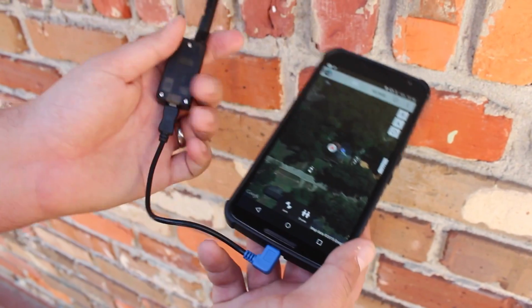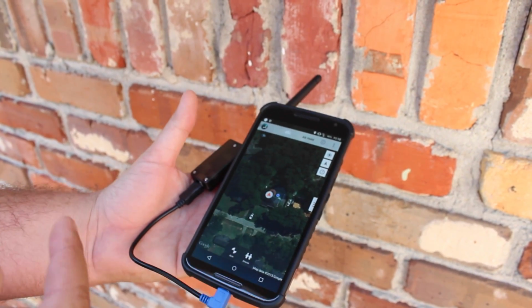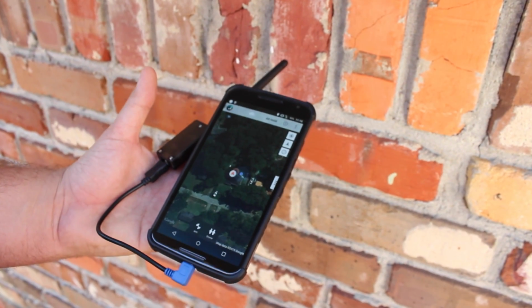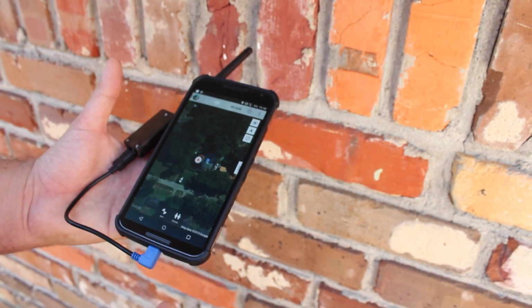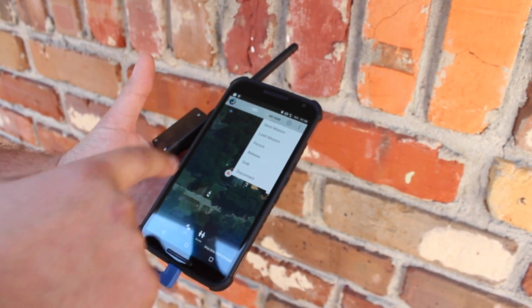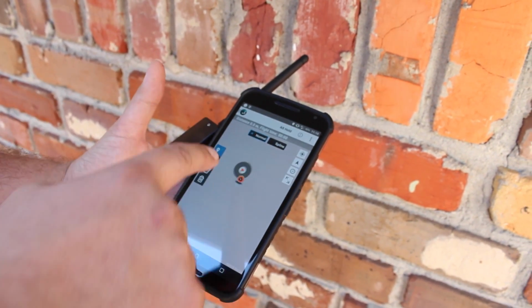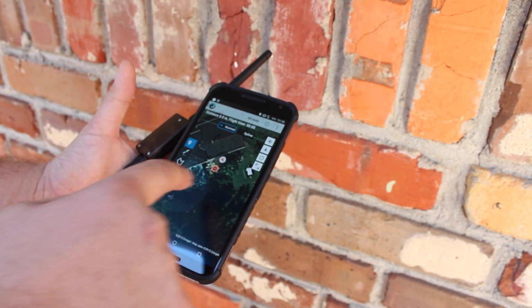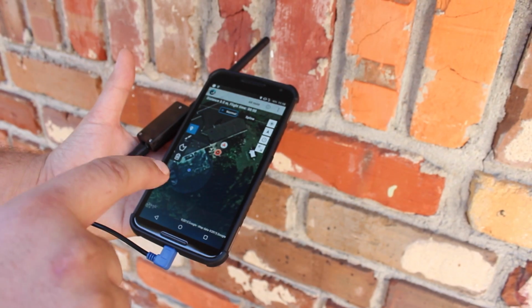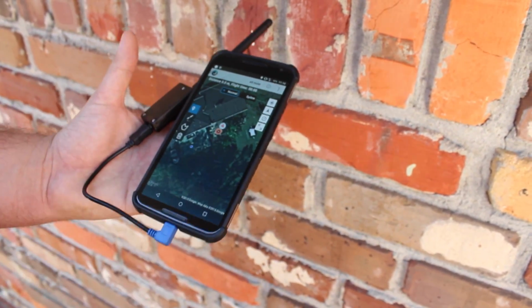Okay, so with the included telemetry radio antenna and the Droid Planner app, which you can get on the Play Store, I'll be sure to include a link in the description, you're actually able to control different things on your drone from this application. So what you have here is the ability to set missions. If we go in here and go to editor, you can actually make a mission. You can make little points on the screen here and tell it to follow those points. You can click go, and it'll fly itself throughout that mission and then land itself when it's finished.